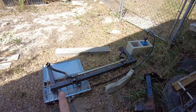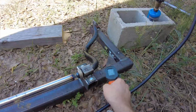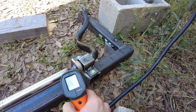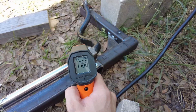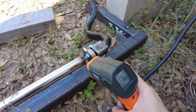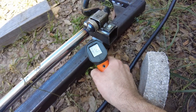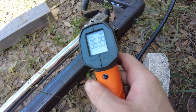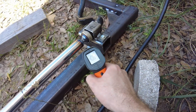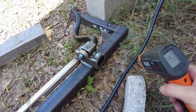I just shifted the jig over — this side was on the preheat you saw earlier. If we go ahead and temp-gun that: 260 degrees; the weld itself: 176 — that's fine. We're going to heat this side now. It obviously got more heat on the bottom just because that was the side closer to the heat.